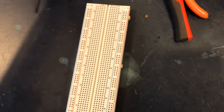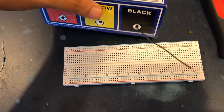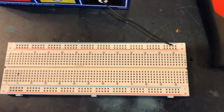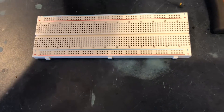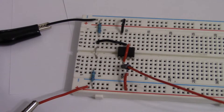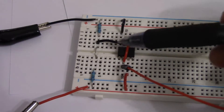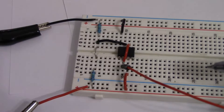Let's begin designing the power supply. I want to create a clean-looking circuit on the breadboard, so I'm going to cut my own wires to the correct length instead of using a jungle of jumper wires from a previous Arduino project. Here's the power supply of the circuit — you can see the voltage divider components and the voltage follower op-amp that isolates the power supply from the rest of the circuit.